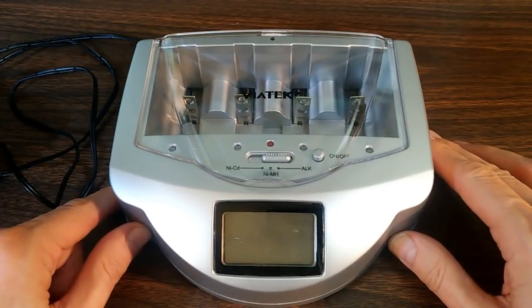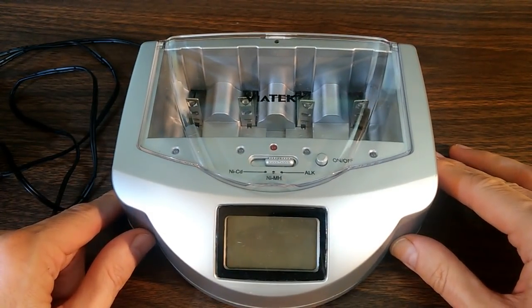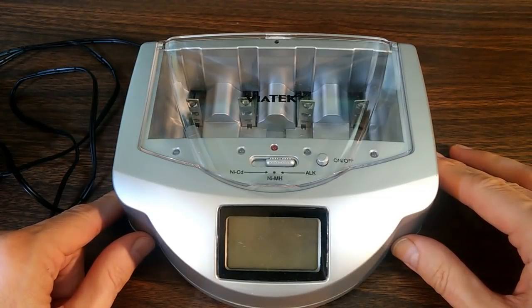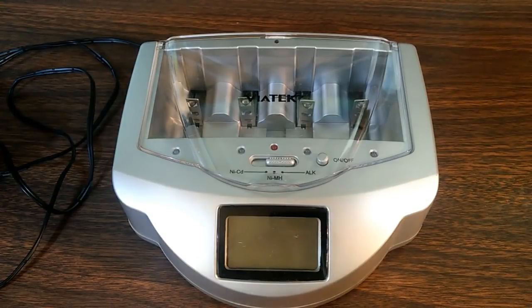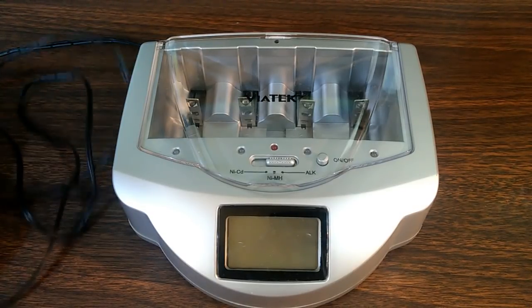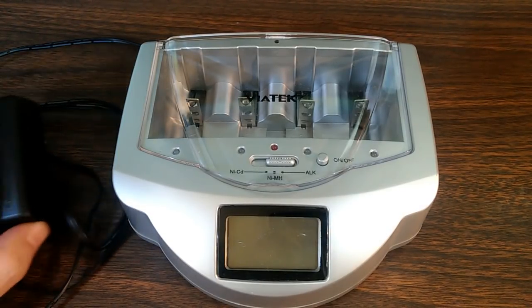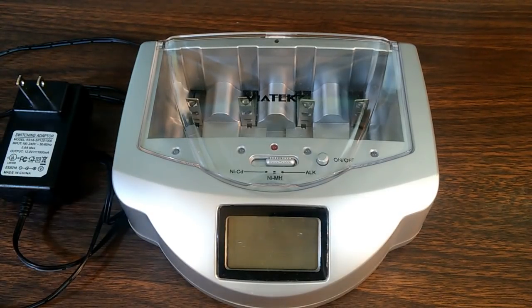The chemical reaction is not fully reversible, it seems, and they will produce hydrogen gas and build up pressure and cause leaking and all that sort of thing. Now, back in the 1990s, there was a kind of rechargeable alkaline. It was called a RAM battery. It stood for rechargeable alkaline manganese, but when nickel metal hydride batteries came along, there was no further market for the RAM batteries.